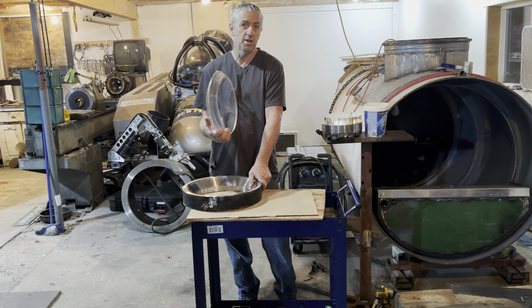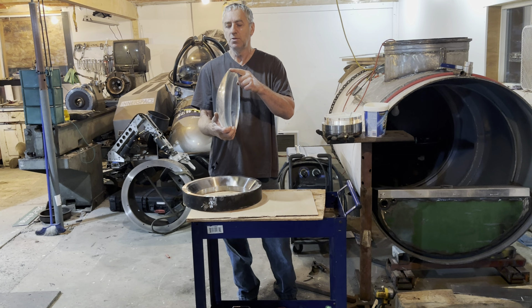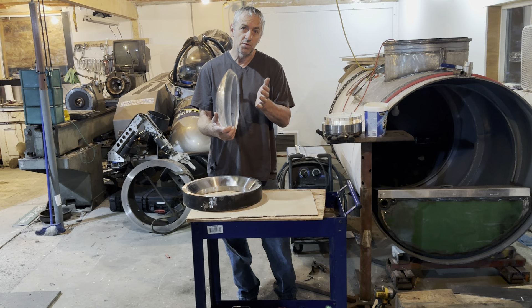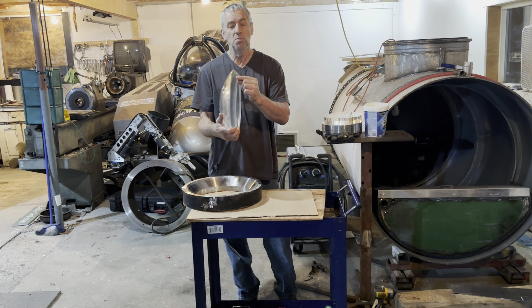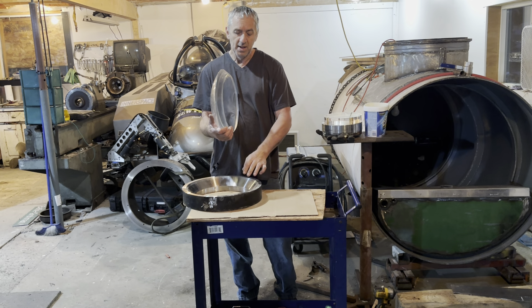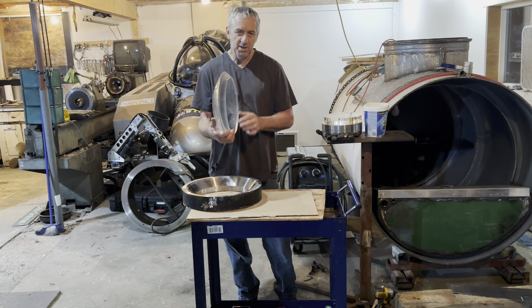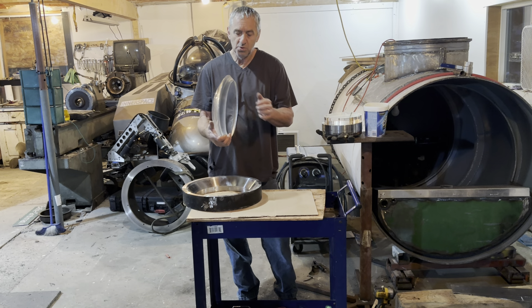This fits the conical seat, but it has to fit within a certain specification. You are allowed a misalignment in the machining fit, but the outside edge must make contact. The misalignment can only be in one direction — the outside edge has to make contact with the seat and the inner edge can have a small gap. In my case I'm allowed seven thousandths of an inch misalignment; last time I machined it, it was four thou.